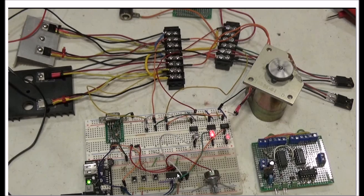Now we're going to a completely different component and putting this aside — these 8-pin DIP chips. These are the TC4420 and the TC4429. They take care of all of your level shifting for input, and they have a very high-powered output to drive both MOSFETs and bipolar transistors.